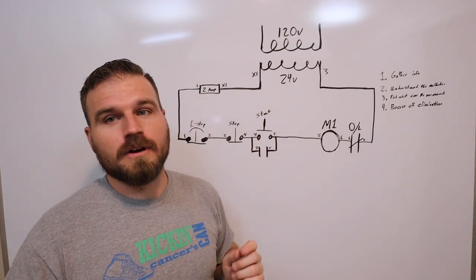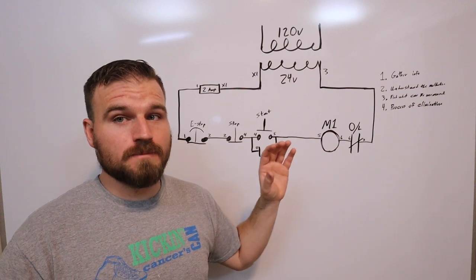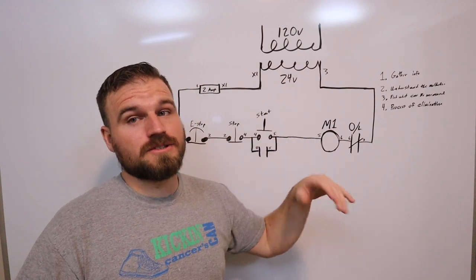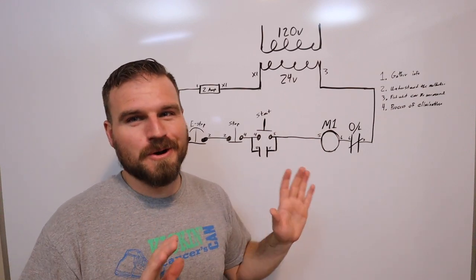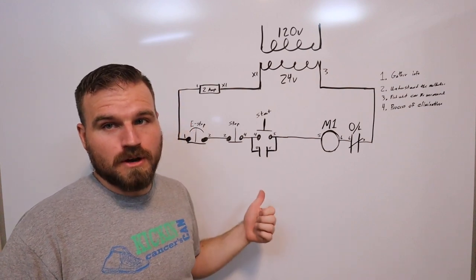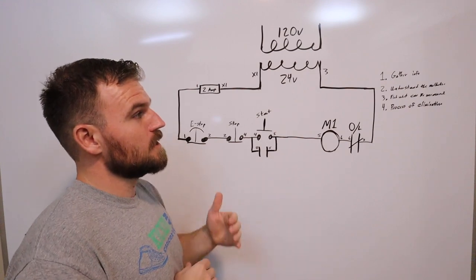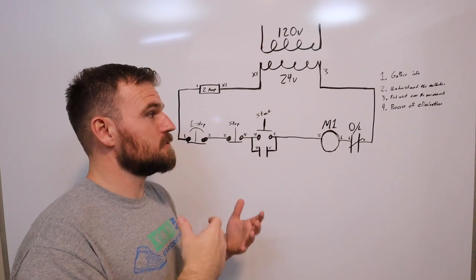In the gathering stage, you need to really look at your schematic and understand how that system is supposed to be working. If you don't understand how it's supposed to work, there's no chance you're going to be able to troubleshoot it — you're just going to be swapping parts until it magically starts working again. That's what this class is really about: understanding how circuits work. You also might employ other troubleshooting techniques such as infrared to gather that information.